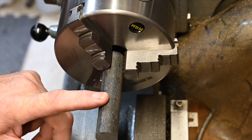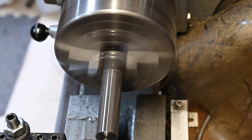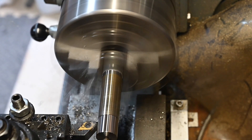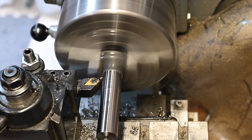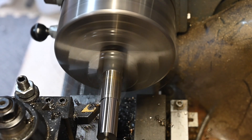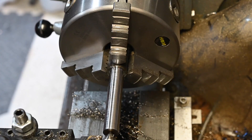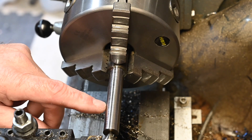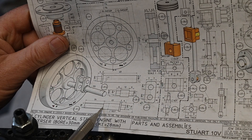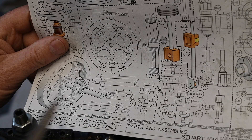Initially I've got to turn the whole thing down to 14 millimetres. Then I've got to take 4 millimetres off down to 8 millimetres at 22 long - that's this dimension here. I'm now going to cut that down to 8 millimetres. I'm not going to put the thread on at the moment - that section is 26 millimetres long.